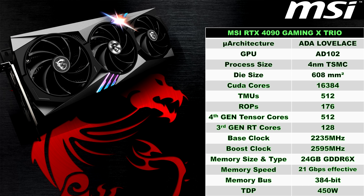This GPU has a base clock of 2235MHz and a boost clock of 2595MHz, though if the boost behavior is anything like previous generations, this GPU should boost much further than that. The boost clock of 2595MHz is the same with both the silent and gaming BIOS — I will be testing this card using the gaming BIOS. This GPU also has a large memory buffer of 24GB of GDDR6X memory, which runs at 21Gbps and utilizes a 384-bit memory bus.